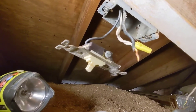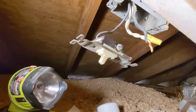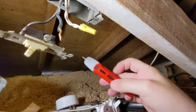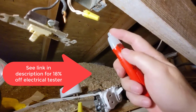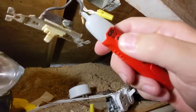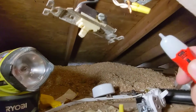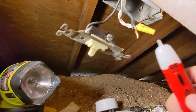Even if you're not an electrician by trade and have no experience with electrical, we're going to show you some tips. The first thing you want to do before you work with anything electrical is make sure there's no power. I'm using a contactless electrical tester — it will light up and beep whenever there's power. You just press the button and put it near a power source. Put it around all your wires and as you can see, there's no power.